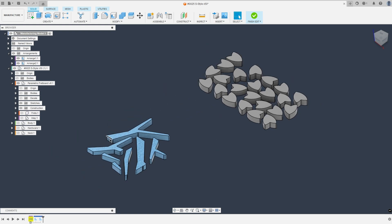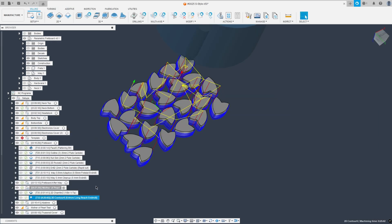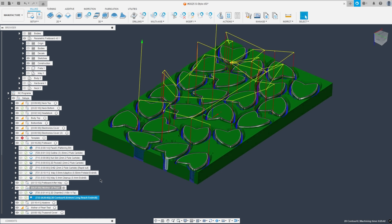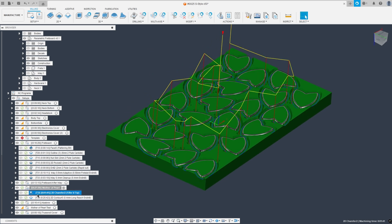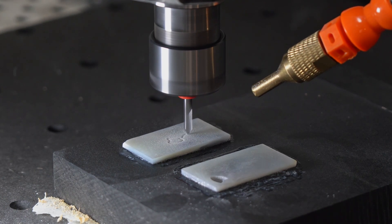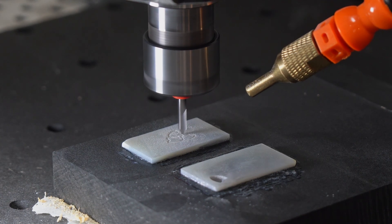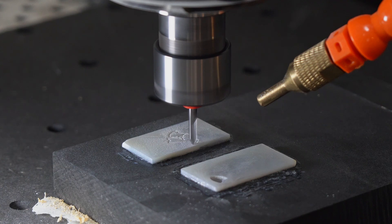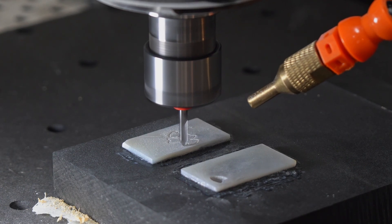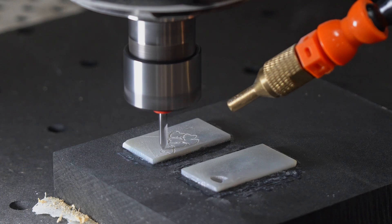The material I'm using is mother of pearl for the petals and abalone for the stems. To cut all of these petals out I'm using two different tools. First I start with a 30-degree V-tipped chamfering tool to just score the outline. This way by chamfering first, my tiny end mill later will have a starting point, as this chamfer tool is a lot more rigid than the 0.4 millimeter end mill I will be using. And secondly, by using the chamfer tool first I get a little bit of an edge break which makes it a lot easier to install the pieces later as there's no sharp corner.